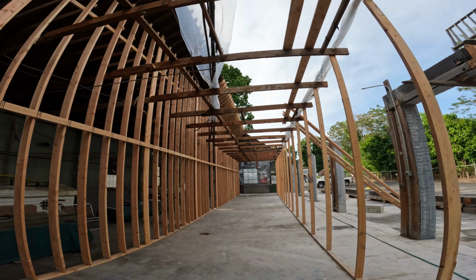We had 5 guys working on framing and myself, and when I got that many guys working, I usually let them do the work and kind of clean and manage stuff while I'm here. So I had to run a couple errands, go pick up some of my special order hardware, and they were cruising on these sistered rafters in the back. And so we got most of what we have to do so far done. There's only 8 more to do where the ridge board's already gone, and then obviously we're gonna sister those up once we do the demo there. You really can't fit these rafters in until that ridge board's out of there.